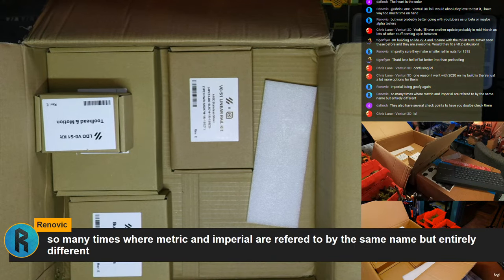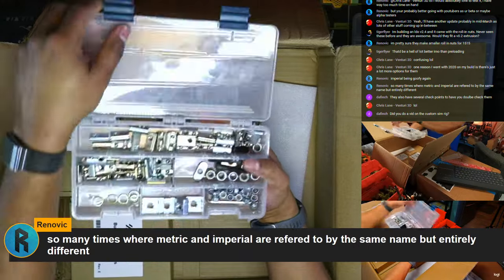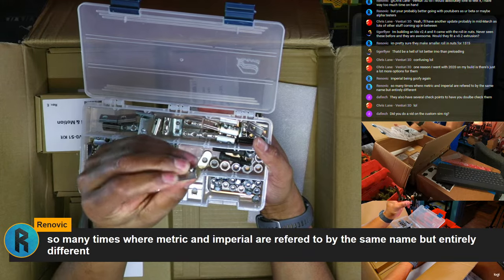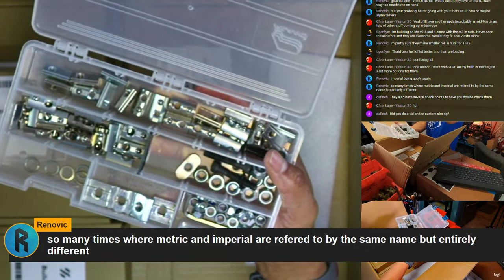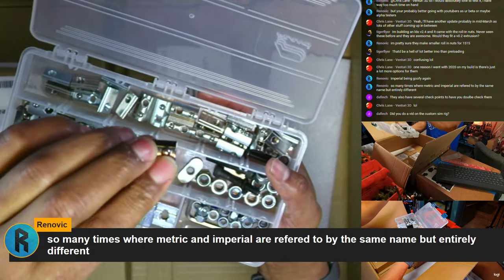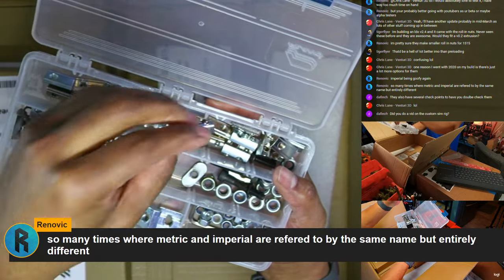I actually have some somewhere. See, these are big chonky rolling nuts from my sim rig. And they have these very hefty ball style guys. You just kind of side push them in, they slide in, and then you rotate around and they retain their positions, so you don't have to use the no drop nut mods or anything like that. They're really, really nice to have. If there is a version of these for 1515 that isn't super expensive, that would be awesome.